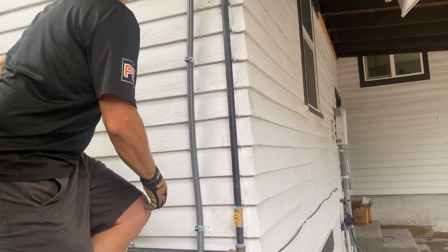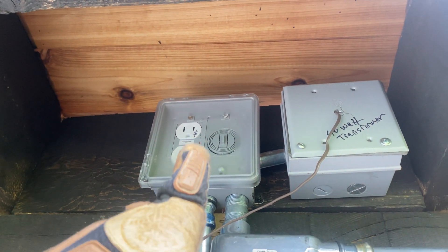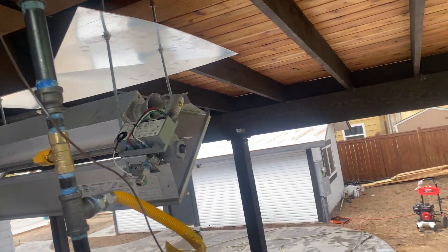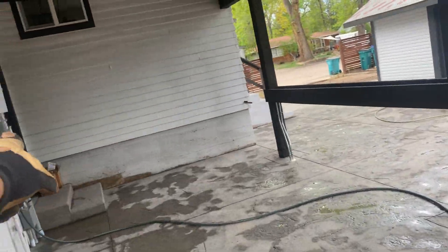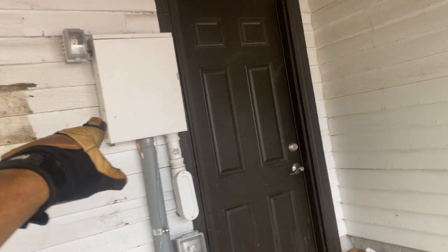Right here we did a switched outlet and broke our tab for the festive lights. That one's going to be for the transformer that goes to my gas heater, and all that will be switched over there. A lot of you might say, couldn't we have moved this panel? No — all those wires for the house for the last 110 years are in here.